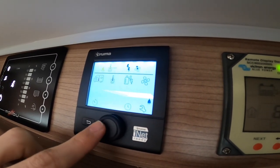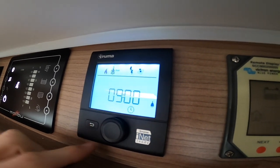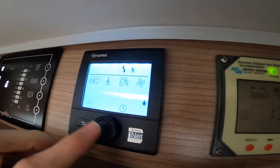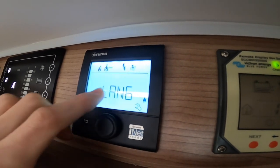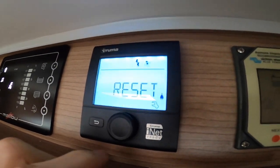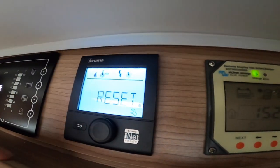There's a timer and a clock display — you can update it when the clocks change. There's also a spanner icon: if you get a warning triangle in the middle, go to reset, press the wheel, it'll say preset, press again, and you can reset your heating and hot water system — though you'll need to set it all up again afterwards.